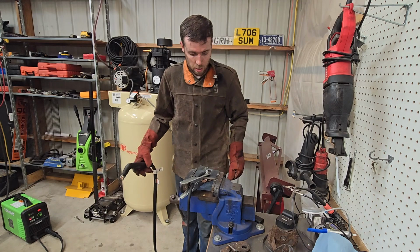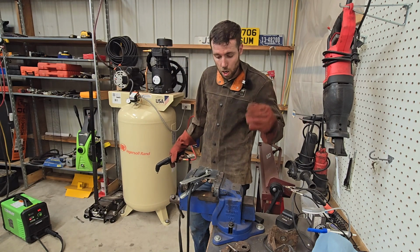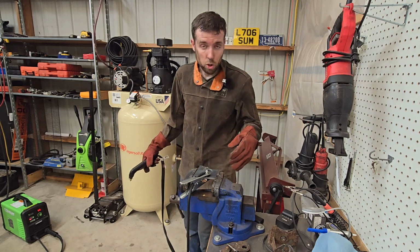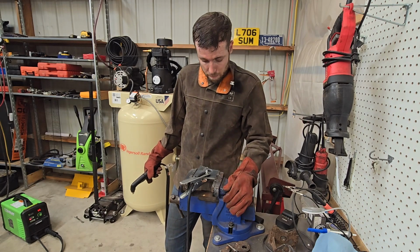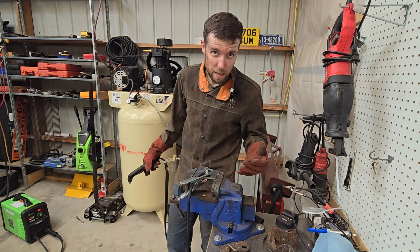Oh yeah. Looks like so far 55 amps, 100 psi, at least for 1/4 inch steel. Now 1/4 inch is what we're going to be working with on the Land Cruiser, so I might just leave these settings right here. This is a cool experiment. Let's actually try to cut a bracket and see what happens.